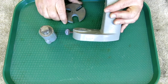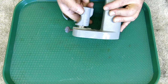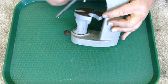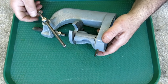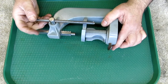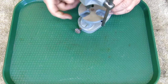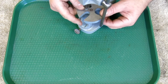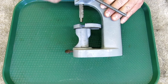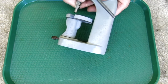You can put in this intermediate stage and lock that in, getting a little shorter working space. It's a kind of a nice little press. No maker's marks on it. It's a good size — you can put it in the drawer and use it for small assembly jobs. Maybe we'll surface grind this and make it all pretty. It's just a plain action, not a compound action — some presses have a ratchet with a compound action as a force multiplier.